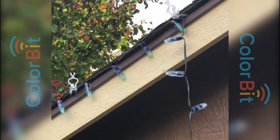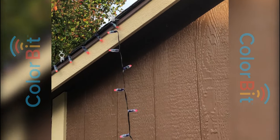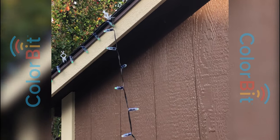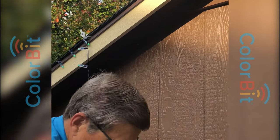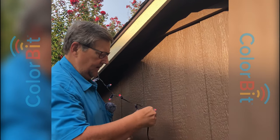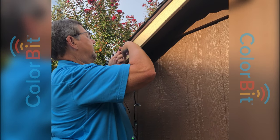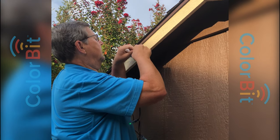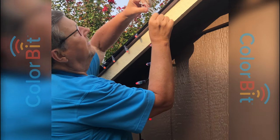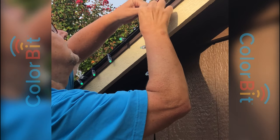Now I've got to move my ladder — just taking a moment. I've got a solid base, going back up. I'll resume where we were. I have another clip here. Do my approximate measurement of four lights. Straighten that out a little better, there we go. One, two, three, four — we're going to put the clip right here. Again, just lift that up, put the clip on, wire over the top in that little groove, clip, you're done. Next one.